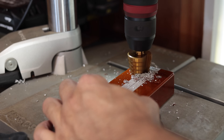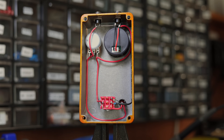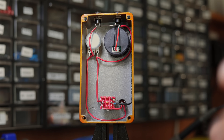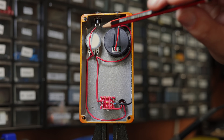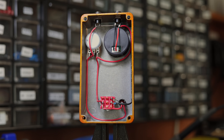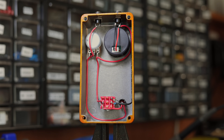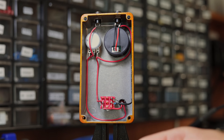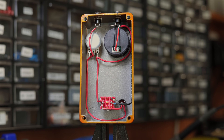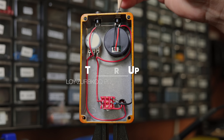It's a very simple circuit. When I build these things I don't really plan it out - I like to improvise. You sort of lay out your parts on top of the enclosure to see where everything's going to fit. The holes are pretty standard: 8mm for your DC jacks, 7mm for your pot, 12mm for the switch, and 8mm for the LED bezel. For the gauge, I bought a 4mm to 32mm stepper bit - it slowly steps up the hole size and I need a 30mm hole. Put your pilot holes in first, go very slowly, and you'll get an absolute perfect fit.